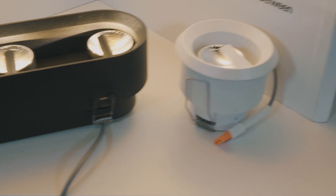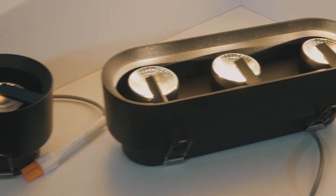The Eclipse is a product that we developed with a new approach to downlighting, which is a totally indirect light downlight. The reason behind it was that as a lighting person, when you go into a space, you begin looking up and the first thing that catches your eye are the downlights and the glare. So I decided to develop a product that doesn't have glare. We used a particular technique — having the LED shine into a reflector, and then the reflector reflects all the light, which gives very nice control over the beam because you're controlling a hundred percent of indirect lighting.